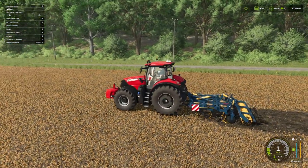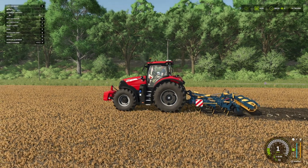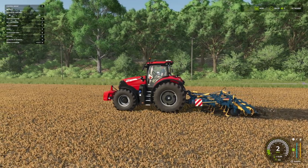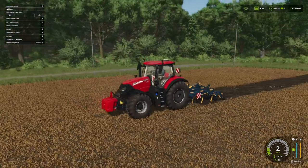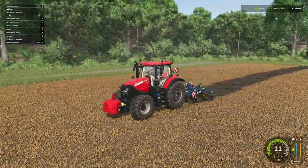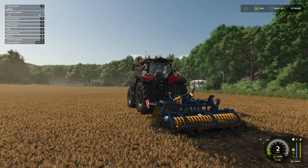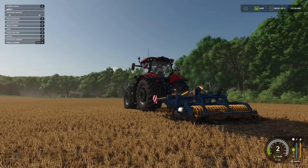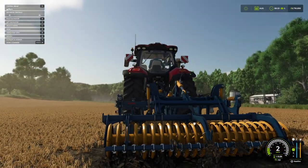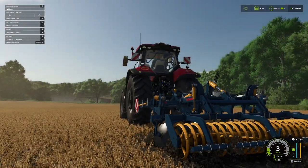I like that the roller is a separate part — so if you unfold without it, that's getting a deep shank in there, more of a chisel-style cultivation. A shallower cultivation then sets the soil. That's cool, I like that. Working speed is said to be 10 miles an hour — let's test that out. Ten miles an hour, there it is. It feels so quick! Four or five feels plenty for me. We can see everything rotating now, the discs turning with the soil, all the individual springs going with each of the shanks. Really nice.